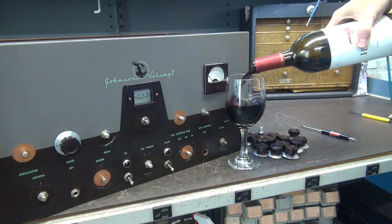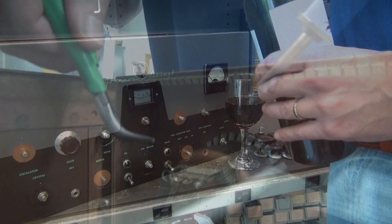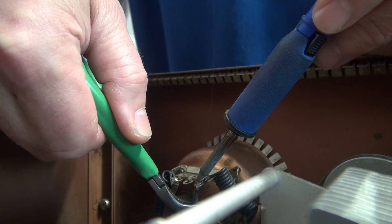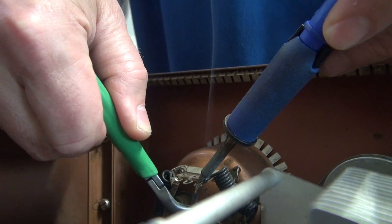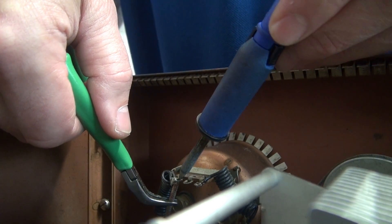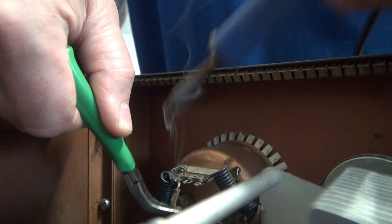The knobs are off. To save damage to your meter select switch and the terminal board on the back of the meter, you're going to have to unsolder the two wires - just a black and a red wire. They come off pretty easy, though this one is extremely tight; I'm probably going to replace it. You're going to have to take these off - don't forget. Because if you pull the front panel and these are still connected, that would not be good.